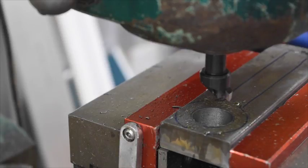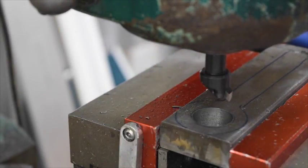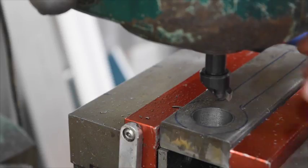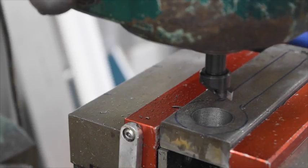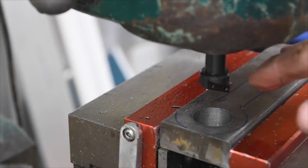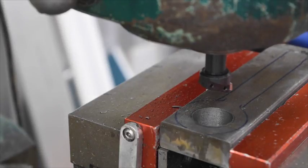So I've got a really cheap fly cutter that I've had for a long time — when I first got the little Grizzly mill I bought a little import three-set fly cutter and never used any of them. I took the tool bit out and reground it, put some back angle on it, and ground it to match the bevel for fly cutting. I did a test piece with it earlier and it actually worked pretty well, so we'll take it from .989" — which is what the hole should be now — to 1.006", working our way up slowly. It's not really indexable so the only way to know is to move it a little bit and try it.